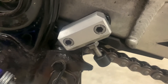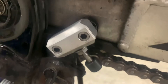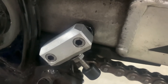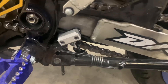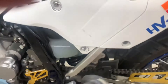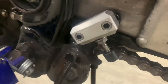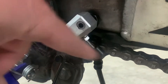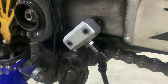The only upgrades I think I want to make are some sort of spring system — a 1/4-20 spring pusher. I want to see if there's something on McMaster that I can just buy that's already like a drawer stopper, instead of just smacking it and bottoming out. It sounds better, but it's still doing the same thing — just putting it into that little tab now. A lot quieter, and it rests about where it should. I didn't run the drill hole all the way through so it looks nicer. But I'm already bottomed out on the thread adjustment, so I'll either cut more off the threaded rod tomorrow or whenever I get around to it. That's basically the only problem I have right now.